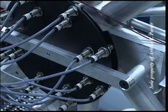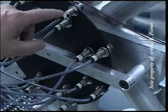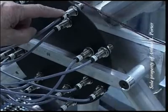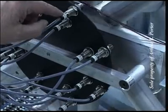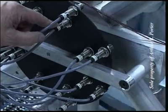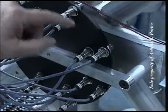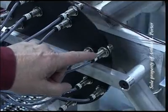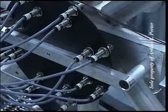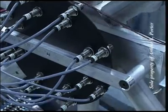and you'll see these things start to light up. See, like this one's lit up. This one is activating the coil in the amplified mode. It lights, then goes out, and immediately this one here fires the same coil up in the neutralization mode. Just reverses the polarity. That's all it's doing. And this one does the same thing in line. This one fires it up in the amplified mode. This one reverses the polarity, puts it in the neutralization mode. Just a continuous process.